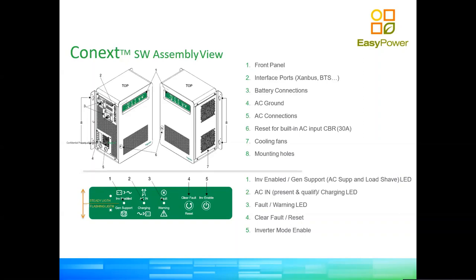Very little to no smart display on the display. You can actually only see what the inverter is doing via the inverter light that indicates it is passing through power and or is producing power. You can see if the AC input is actually being qualified. When Schneider speaks about qualifying a source of energy, it means that the source of energy has been verified to be within certain parameters. In the case of these inverters, they comply between a maximum and minimum voltage and maximum and minimum frequency. Both of them can be changed.